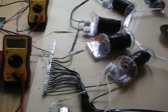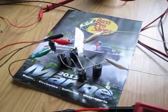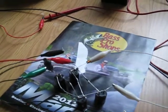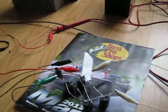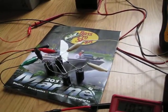Hey, morning guys. SD here. I was talking with Doug. We were using this quad setup here that Poppy came up with. And I put a 1N4007 on the positive end output going to the battery so it couldn't back feed back into the caps there when we were shutting the system down.